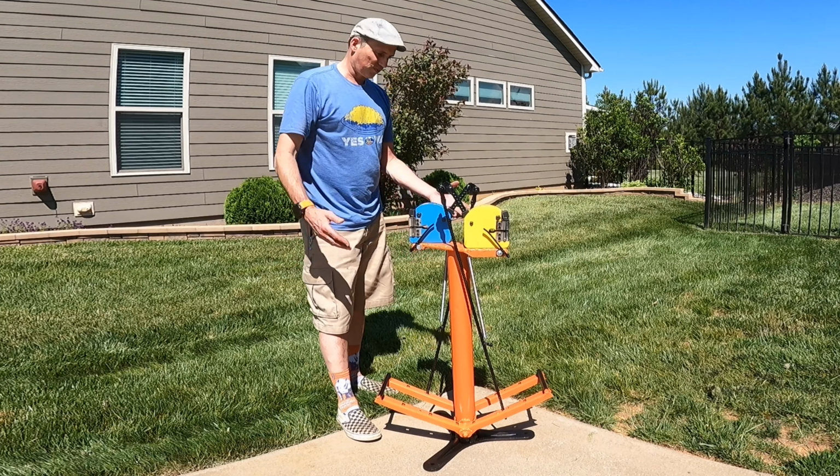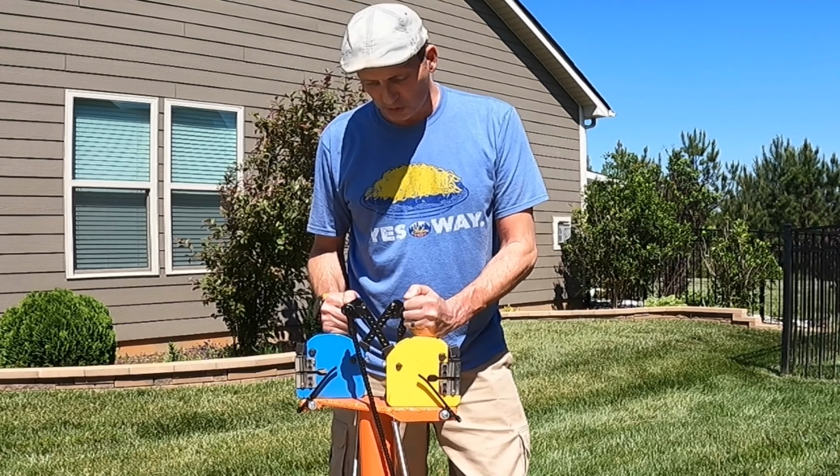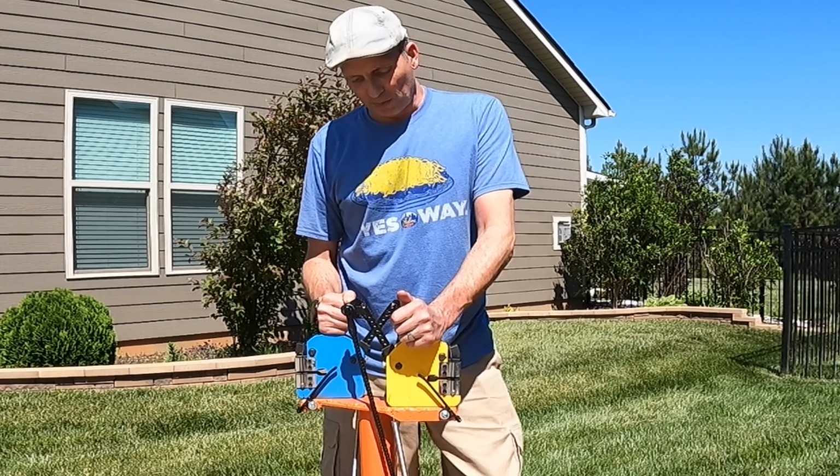Will say one thing about my actual shrinker stretchers. These are Kastforce KF5005 shrinker stretchers. They are a little more expensive than the Harbor Freight ones you can get, but the Harbor Freight ones only have like an inch throat, where these have a 2 1/4 or 2 3/8 inch throat. So you can do a much deeper flange on these, which I like. I think the price difference is like $30, not on sale, etc. So I would definitely want the Kastforce over the Harbor Freight ones, just for that throat depth alone.